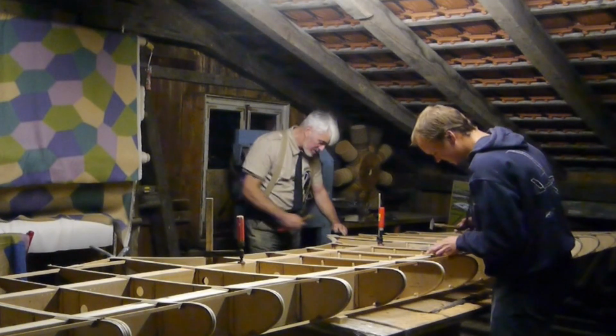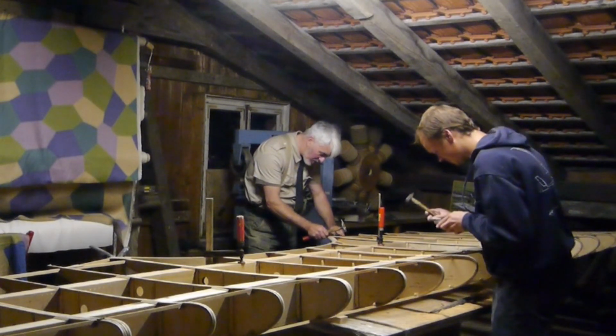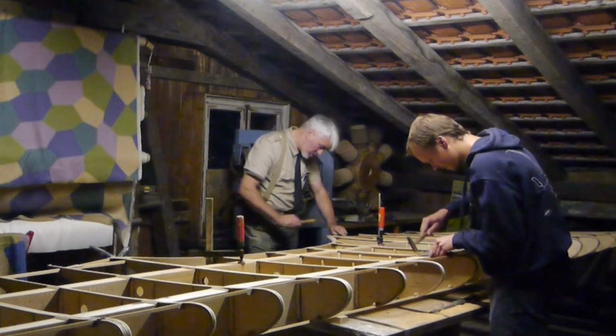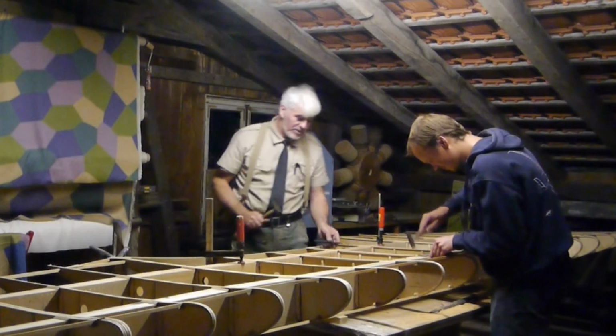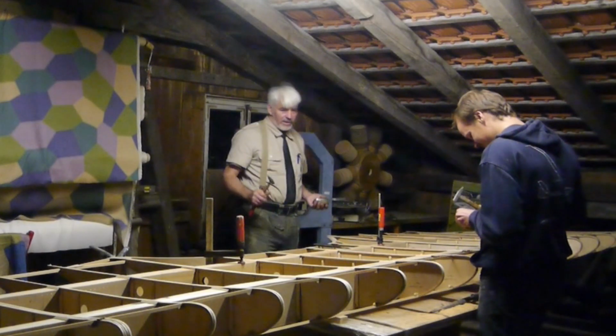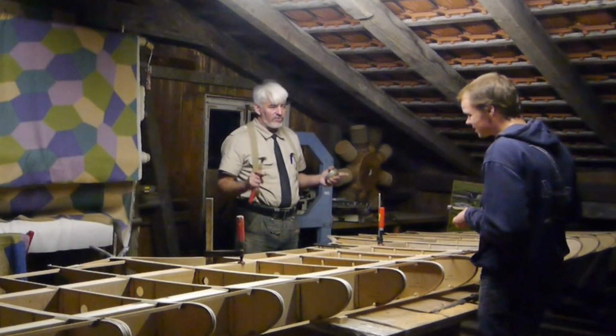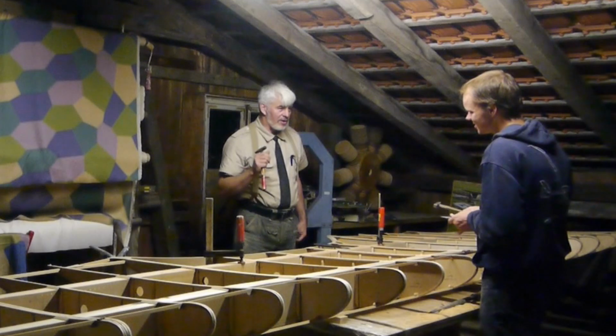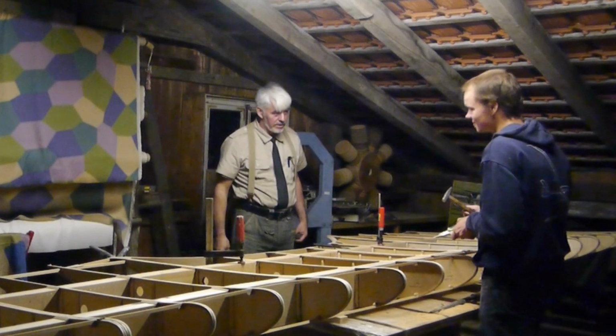In the early days they left the iron pins in, because if you have a rotten nail in it or a hole, pulling it out doesn't matter, it doesn't hurt the wood anyway. And we did the calculations for this wing, we need about 4,200 nails, and the nails we use would come up to around 100 grams, so it doesn't matter much, you can leave them in.